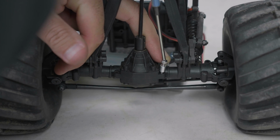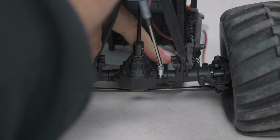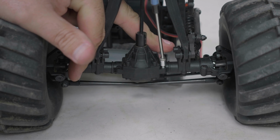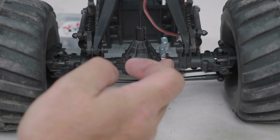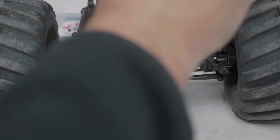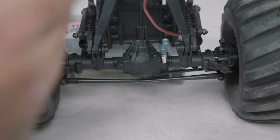It's going to be a tight fit. So if you have a drill, it's probably best. It's basically going to drill itself in. Because this is not tapped or threaded, they've used a little bit bigger screw piece here, which means you're really going to have to drive it in there. So getting it to start threading at first is difficult. If you're doing it by hand, it might be a little bit of work. If you have a driver like I just used, that is ideal.